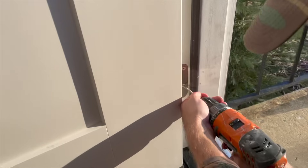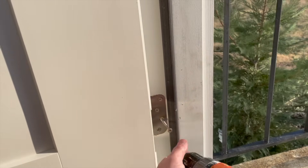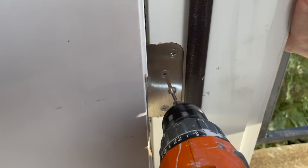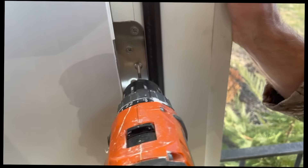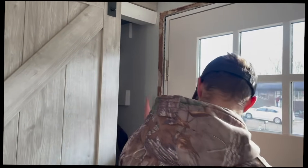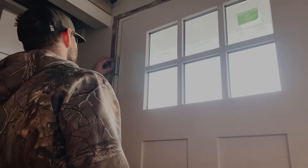At this point, install one screw through the pre-drilled hole in the hinge — this is temporary just to hold the door in place, do not over-tighten. Next, confirm that the door is plumb, level, and sitting properly in the door's opening. This involves checking that it's flush with the drywall on the inside and that the brick mold is totally pressed up against your home's exterior. Then check the plumb all the way as you go up, installing screws temporarily in the hinges — we're not over-tightening at this stage.